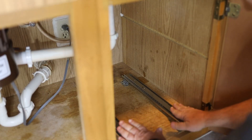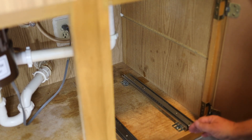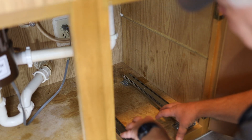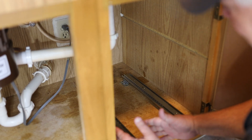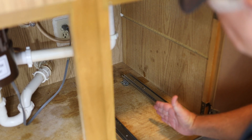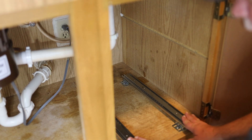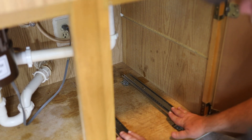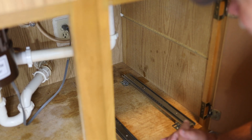There are some things to consider when putting these rails in. I decided to put mine up closer to the front — make sure your cabinet door will close and you're not going to hit them, because if you slide these all the way to the back you'll have empty space and you can't put anything there without having to remove everything to slide the shelf out. Also make sure you have the rail over far enough, because there's a lip on your cabinet that could hit the slide out shelf if you put it too far that way. Put these in where you need them and think about how it's going to fit best.